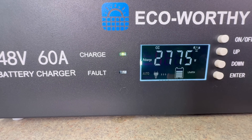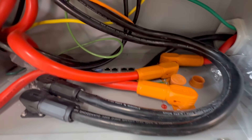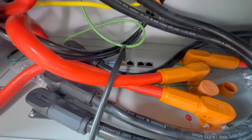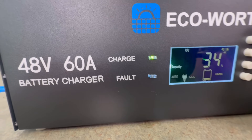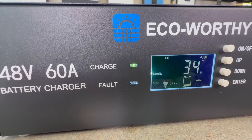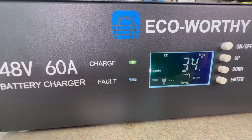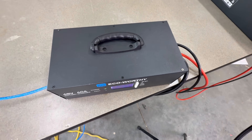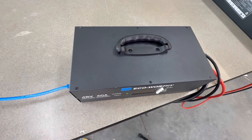Let me hook it to the wall mount battery — that'll be the last communication test. This is the EG4 indoor wall mount battery. Hook to the CAN port. Yeah, that is definitely working — the wall mount battery is low, it says 34%. So while we're charging the EcoWorthy battery over here it thinks it's 34% because I plugged it into the wall mount battery. It can communicate with basically any battery that uses Pylontech protocol via the CAN port. Noise level is about the same as the ChargeVerter — maybe a slightly lower tone, but pretty much the same amount of noise.